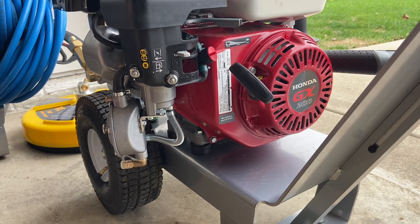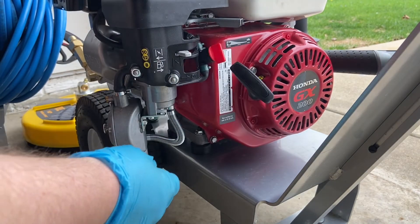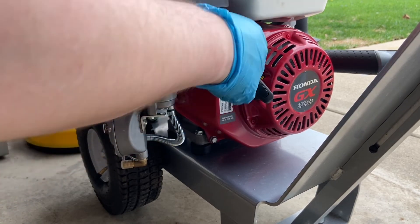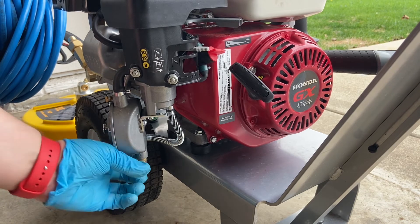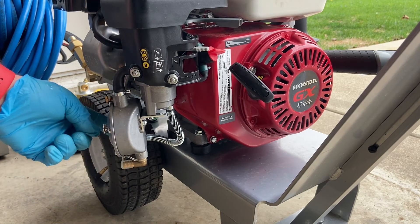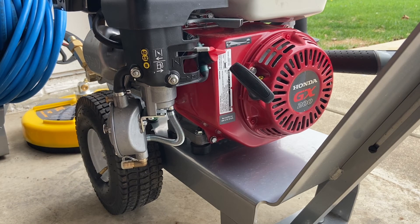And that's it — this is all set to go. It can run on either propane or gas from the tank. The on/off is moved here: that's off, now it's on. Not choked, choked. To start it, the throttle's here. I just leave them off when not in use. Here is for the propane — you pull that little protective cap off and hook the hose up, then shut the fuel off on the side and purge it. So this motor can now run on liquid propane, natural gas, or gasoline.